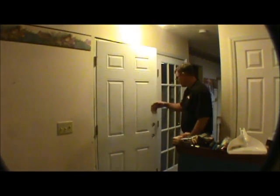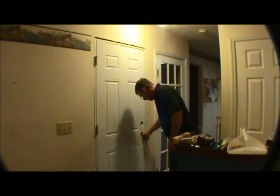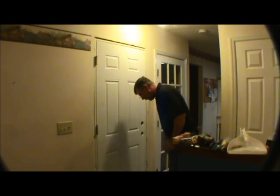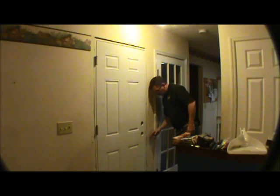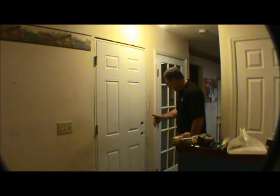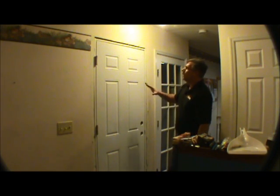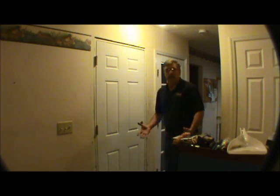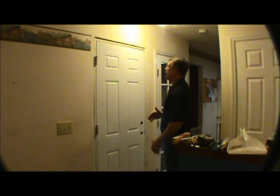And then we'll try our door swing. That is a really nice fit. I like it. When I trimmed the bottom of the door up, I messed the drywall up, so I wasn't able to line that up. So I'm going to try to take that screw out and get this bottom to kick in just a little bit. Now the trick to the door fitment is that it's really just eyeballing. You just want a nice consistent gap all the way around, and that's what you're after there.